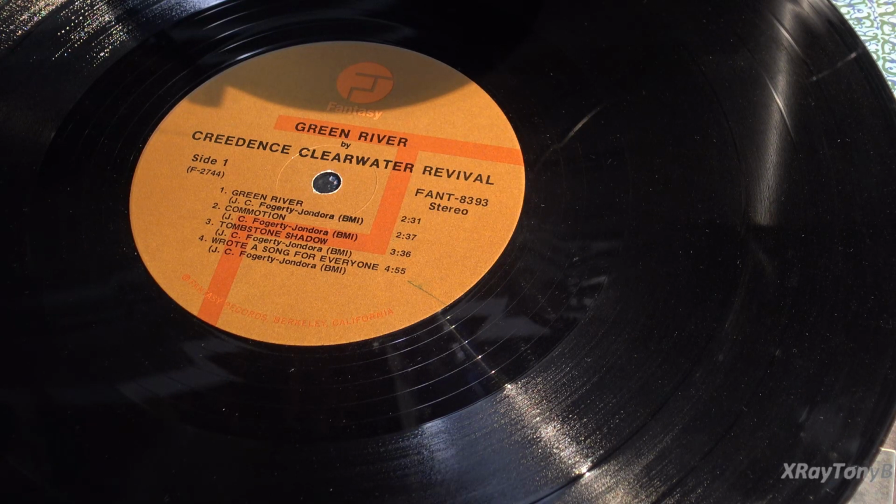If any of you ever tried to just take a magnetic cartridge turntable and plug it into something that did not have a proper phono stage, you would rapidly find out that it doesn't sound very good. It sounds very tinny and shrill, and it doesn't sound right. That is why.